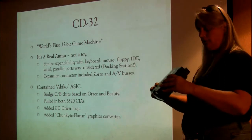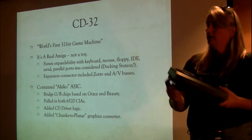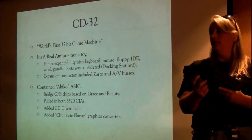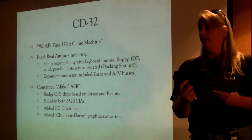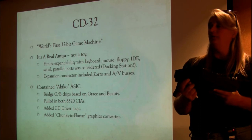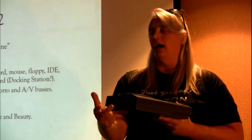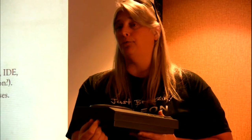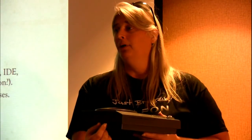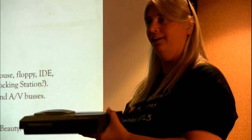serial port. Where did we put it? Yeah, it was labeled AUX. What it was is the keyboard port from the A4000, the small round one. But it also used two of the extra pins to do a TX and RX serial port on it. So you could break it out and have a serial port for debugging and for anything else. A modem, right? This was back in the day when Ethernet cards weren't all that common, but dial-ups were still real common. So the concept was you could do multiplayer games over the phone dial-up networks, and wouldn't that be cool?